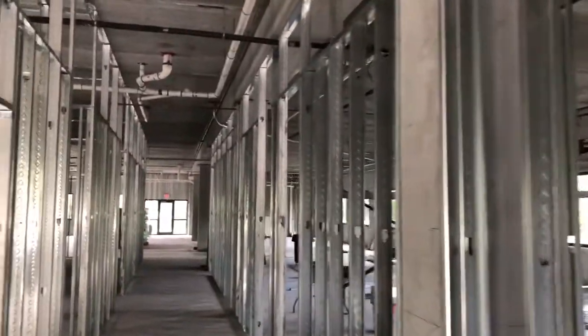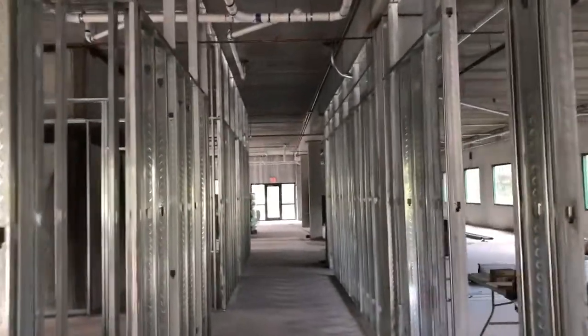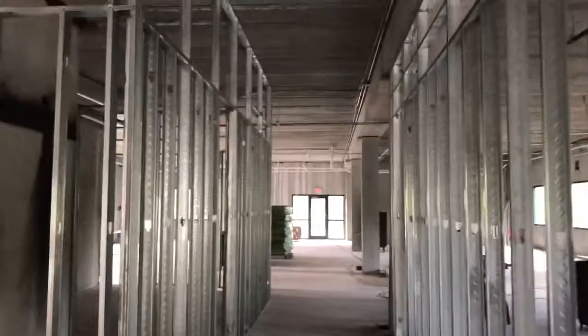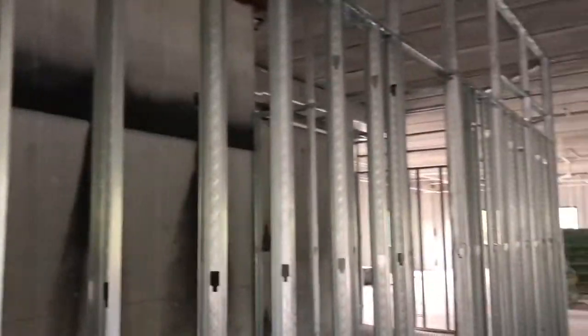As you can see, our deck height is much higher than our ceiling height. It's about 12 foot 6. So we ran our bottom track, and then we ran a top track right on the deck above. I used the taller studs, 12 foot 6 studs, and I put them in every 4 foot. That gives us the bracing on the wall. Then we put in the cat that holds the other stud, but it's called a draft stop. That draft stop will keep anything, if smoke gets inside the wall, it won't go to the other side of the wall. Those are going to be the ceiling heights.